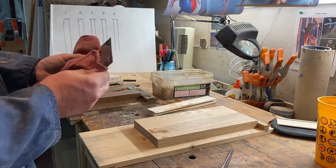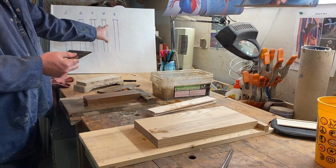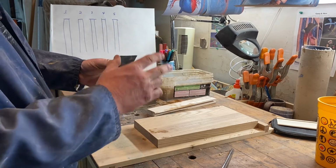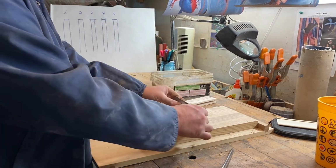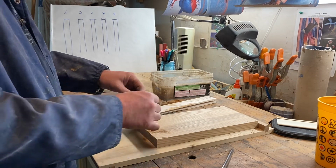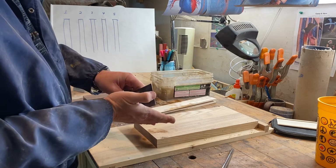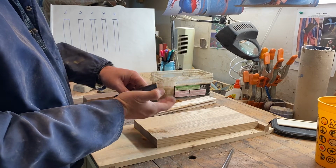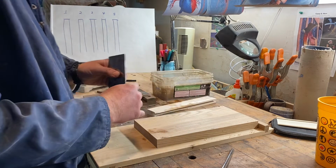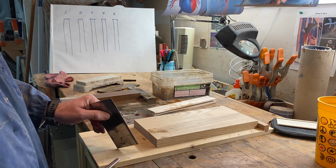All right, so at this point, those horns are poking straight up, parallel to these faces. So they're up in the air here. Now, if I were to do this, there's no way for that steel to make contact with this board. So in order to put this in the useful position, I need to fold those horns back down so that when I put this on the board, it starts to do its job of abrading or pulling this material away.